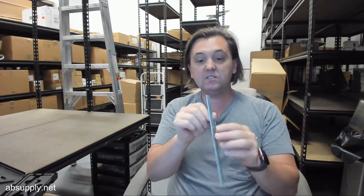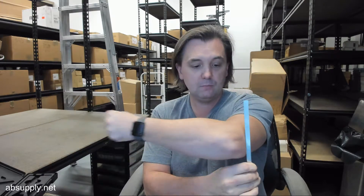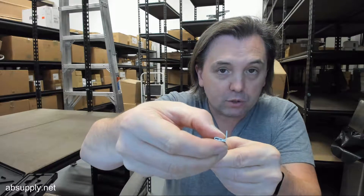This weatherstripping is used in a door installation — in a single door, or in a double door, or in windows. You've got a hinge jamb, you've got the header, and then you've got the lock side. The 16AZ is nailed to the jamb after a slot has been cut into the edge of the door, so that when the door closes, if my elbow is the hinge edge of the door, the slot is going to seat over that rib portion, creating an interlock with the door.